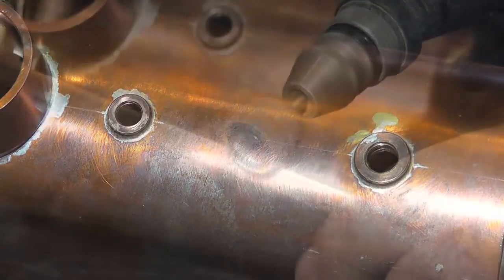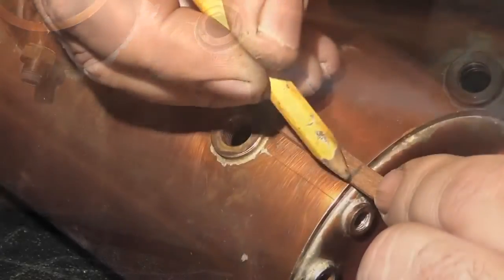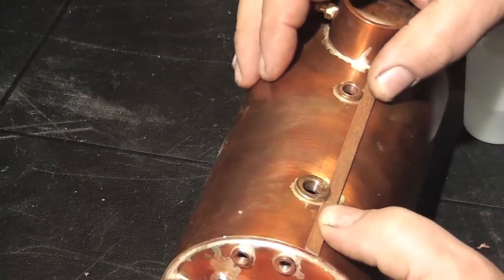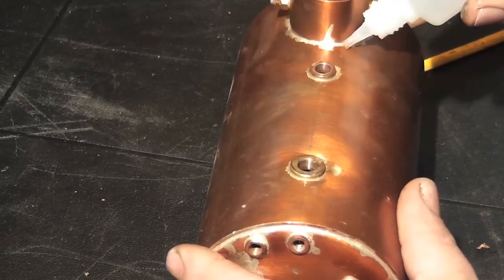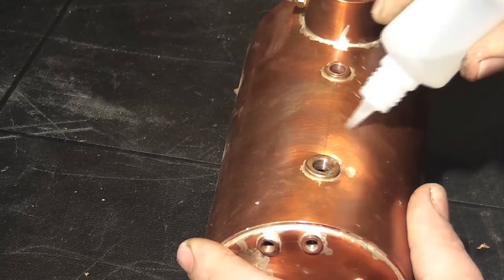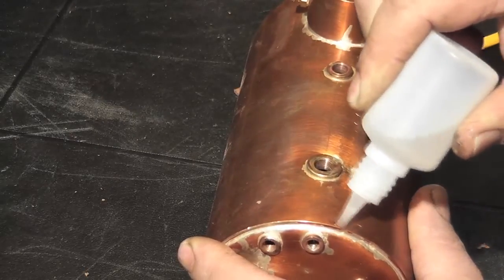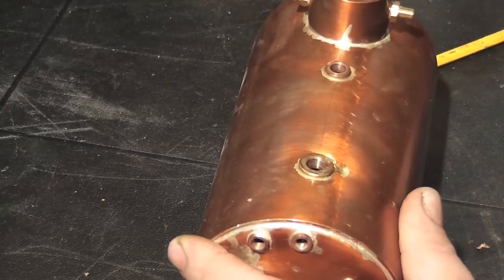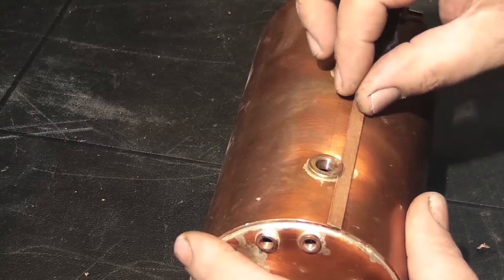For these kind of operations, I use one of these — it's my little mini craft drill. Once the mahogany strip sits parallel with the centre line, cut it to length on the bandsaw and stick the strip in place with cyanoacrylate adhesive. I find cyanoacrylate adhesive the most useful of all adhesives for what I'm doing. Although it initially sticks to the copper, allowing us to sand the boiler clad into shape, when the boiler is in use the cyano will part company from the copper itself. The mahogany is held in place by brass banding anyway.